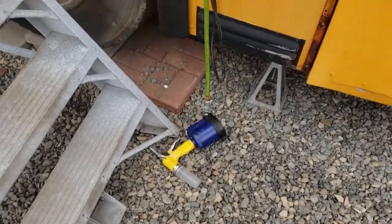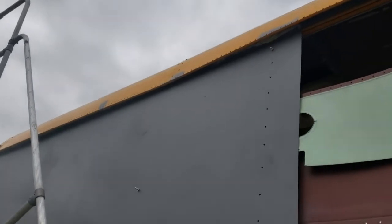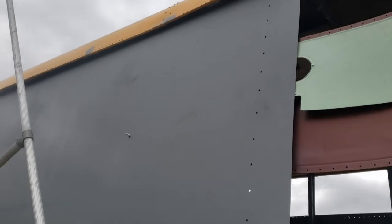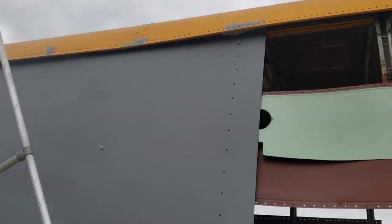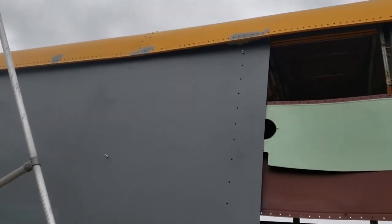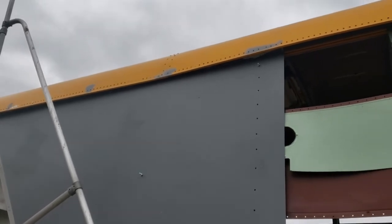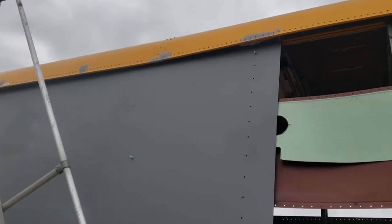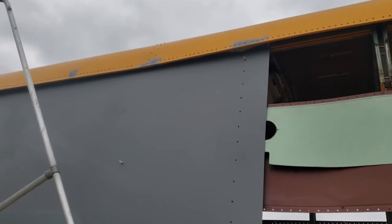Okay, so I'll be taking that pneumatic riveter on the ground and riveting those in. I've got caulk underneath. You might be able to see it in the picture, but I'm going to start that second rib over because it's already kind of close due to a rivet I didn't remove, actually making it easier. So anyhow, I'll go one by one down the row. I'm going to dab a little caulk on each rivet as I set it so that the outside of the head will get sealed on the outside a little bit by the caulk.